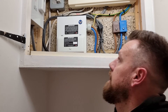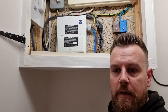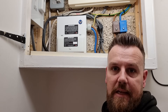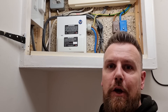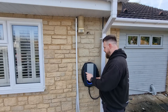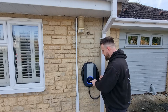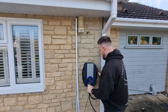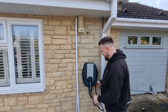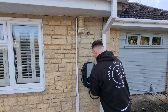The manual is super easy to understand for the Viva and it's nicely labeled so you can't really make a mistake. At the charger end, the CAT5 we used to join to this in the EV Ultra — the shielded CAT5 — it's important that you use that screening to ground the cable, and that stops any interference. I'll get Peter to label that up. Outside, looking at the finished article — absolute beauty. I put the second interchangeable front cover on so it's two-tone, which I thought looked nice. The charging lead can plug directly into the front; it's just a case of reconfiguring to keep it tidy. I hope you've enjoyed this video — leave some comments below!